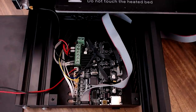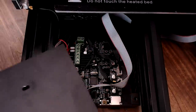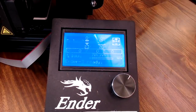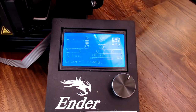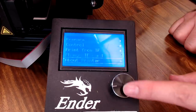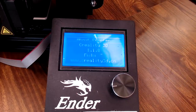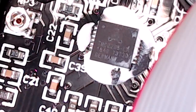And last but not least, we plug in the LCD screen, and the wiring is all done. Before we put the cover back on, let's boot up and see what we've got. We power on - screen came on, that's a good sign. The thermistors are reading correctly and it does say it's an Ender 3. This board has been pre-installed with Marlin and should be configured correctly for an Ender 3. Heading into the menu to About Printer, we have Marlin 1.1.8, which is pretty standard for these replacement boards.